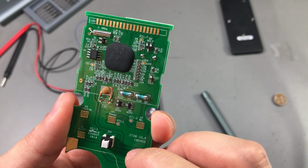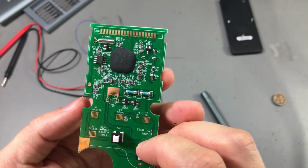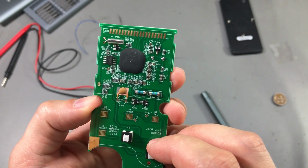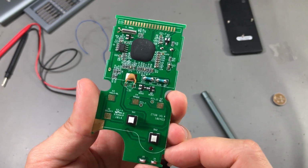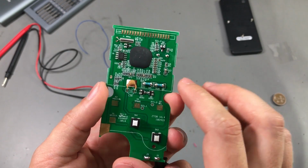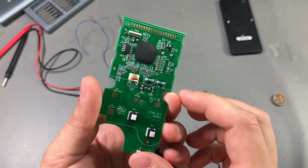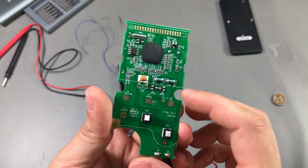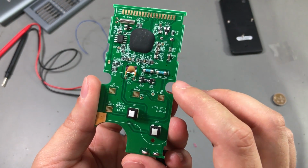We don't know what multimeter chipset they're using. I believe this is an EEPROM for storing some calibration data. It's surprising to find this on such a low cost multimeter, but maybe these newer multimeter chipsets don't have pins for external calibration pots anymore. Maybe they just use an EEPROM, so they are forced to use an EEPROM.